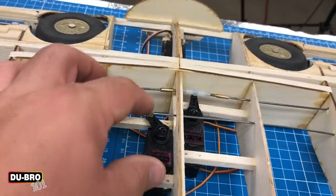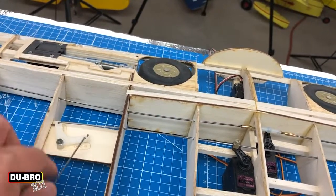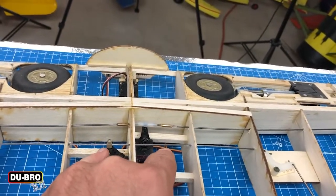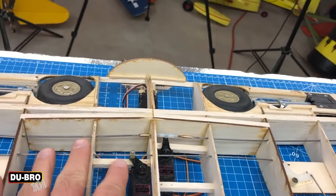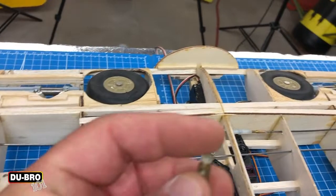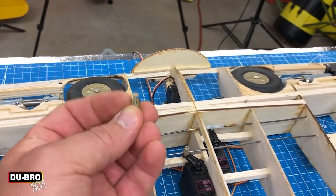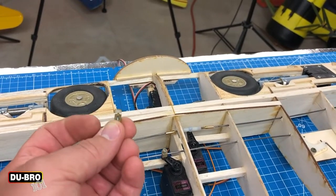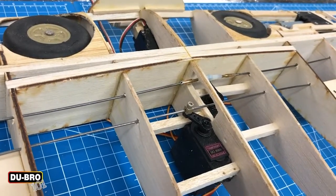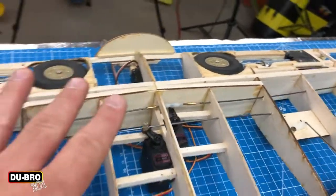It's a little bit more of a buildup compared to the single-rod solution on my flaps — I had a piece long enough to do one single piece, so I'm risking it a little bit there. But it's a lot more secure than drilling out a connector. Don't drill out your connectors; they're not engineered to do that. This connector is not drilled out, so it's not going to round out, it's not going to oval, and the set screw is not going to back itself out once it's secure.